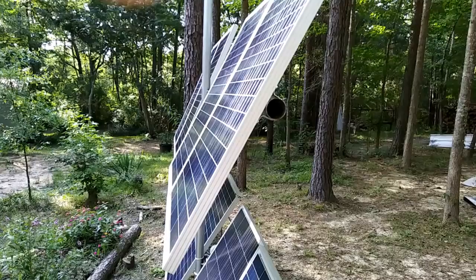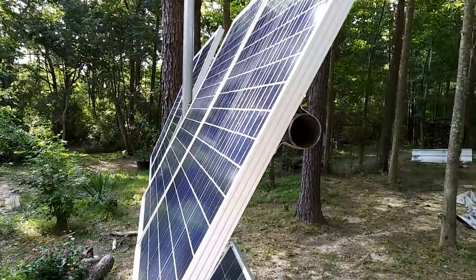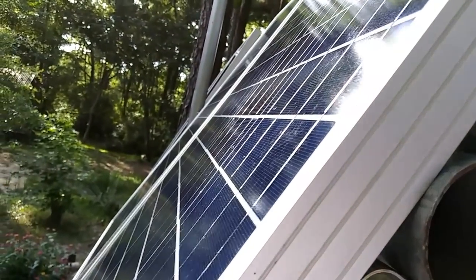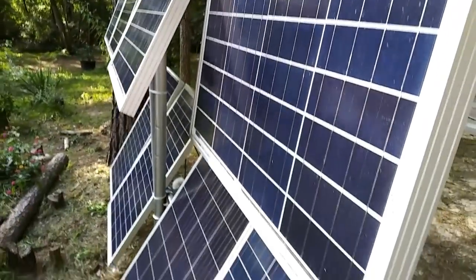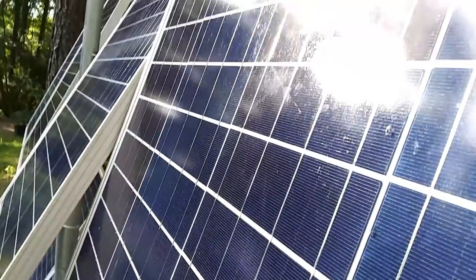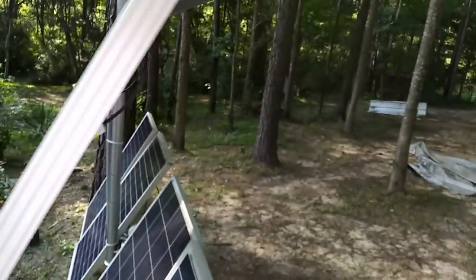I talked about this solar panel mount that I made that you can tilt up or down and move the whole thing east or west. With one hand, the way I've designed this, you can grab one of these panels and tilt it up or down. I'll go through and tilt all of them with just one hand. The reason for that is the sun is lower in the winter and higher in the summer. I'm moving that panel down — you can do all eight on this rack like this because the panels are only mounted in the middle. Now I'm moving it back up, leveling with the other panels.